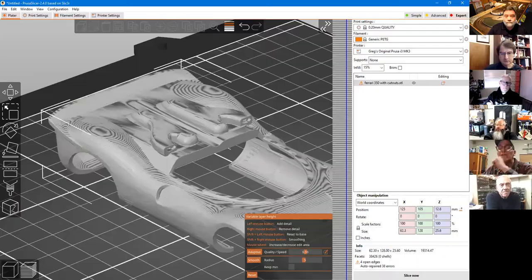I forgot you could also change the nozzle to a 0.2 instead of 0.4, if you're willing to put the time in. And then the other thing is that if you go look at other groups that do miniature war games, they do a lot of tinkering on this to get FDM printers to print little knights that look not so choppy. Yep. I forgot all about that. I should go take a look at that.